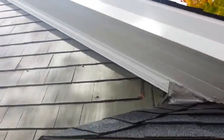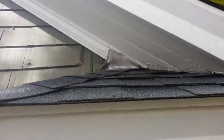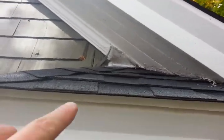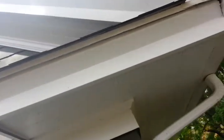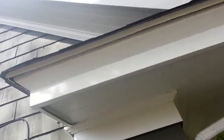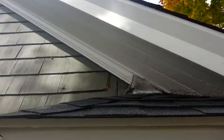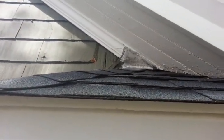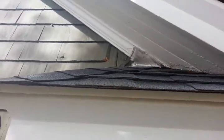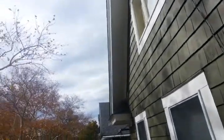It looks like maybe they did a painting job because it looks freshly painted. Even the siding looks painted. And I could see the flashing where there's paint on the flashing. So I guess when they painted the house, that's where they did the repair. That actually is pretty adequate. For a painter job, if you're going to make your house look nice, you'd want a more finished look. What I would have done, if I wanted to make it a finished look, I would have put that hardware cloth there and then put a piece of cut flashing on top and painted that.